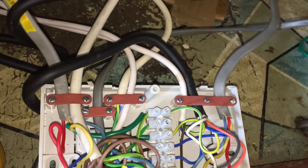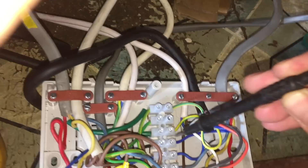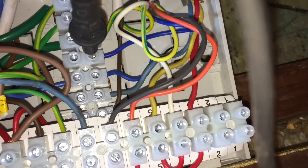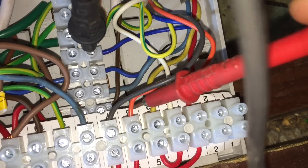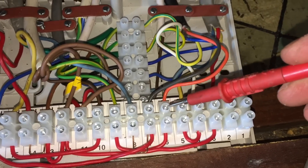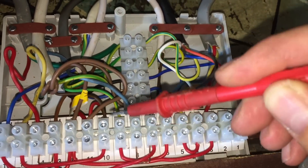Seeing this for the first time like me, I was trying to work out what's what — just looking at the cables running away, seeing where they were going, trying to identify easily what was what. With all wiring issues, start with the things you know should be correct, which is the three-port wiring. The three-port wiring should help you identify what all the other wiring is. There's the neutral for the three-port. One test on the neutral — we're on orange, so on hot water on we should have 240V, and we do. That is correct.